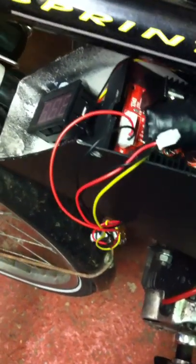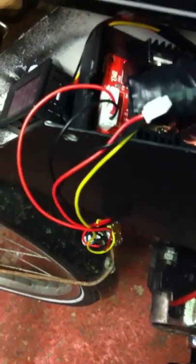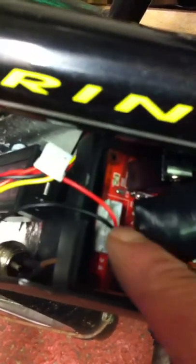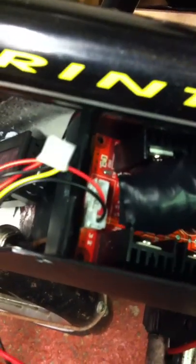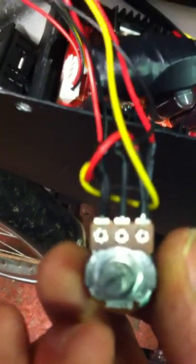I've been exploring what goes on with one of these PWM motor controllers. Essentially the potentiometer has got a switch in the back — the two-terminal part is just on/off, which I don't really care about. I can short that out and it wouldn't be a problem because I feed this with power from the three-phase rectifier anyway. On the other side of that there is a 100k pot.